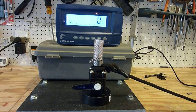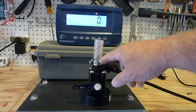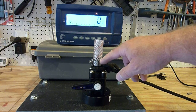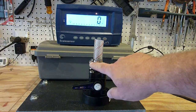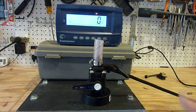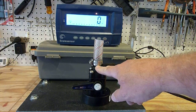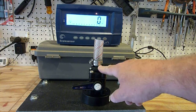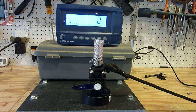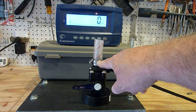What we're going to do here today is an ABYC load test. We're supposed to be at the innermost hard piping, which you can see right behind the clear tube here. I've just put a knot in the hose clamp and the hose is just really there to hold it on the barb as we put some load onto it. The test is that at the innermost hard piping — we're a little bit below that so we don't have quite the leverage — they want to see 500 pounds for 30 seconds.